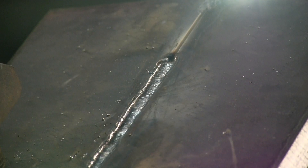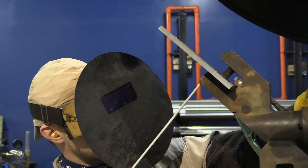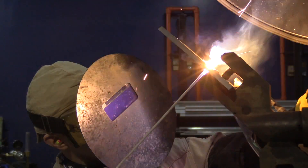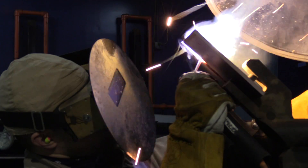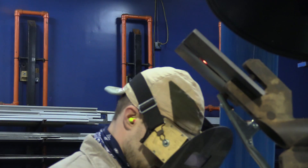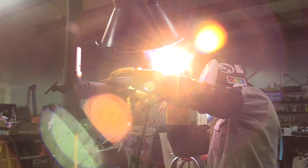Let's get back to the welding. Just as a reminder, every restart — whether you're going from or going to — needs to be feathered back like this. Tacks on both sides and all restarts. It's just necessary to burn out a crater hole. Here's the rod angle again — the machine is reading 73, we had it set on 70; that changes a little bit with arc length. Let's look at that last restart. You can see that crater hole plain as day right in there. If you hadn't feathered that, it would just be in there and show up on x-ray. That means a repair — might even have to dig up a hole — and it costs money. You want to get the x-ray right the first time.